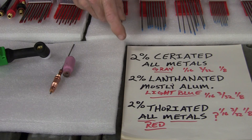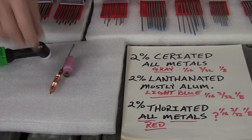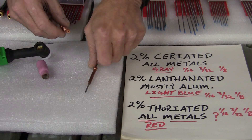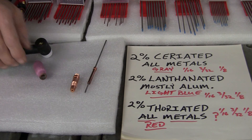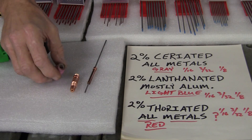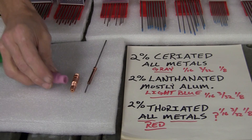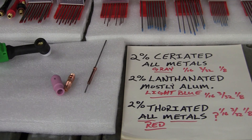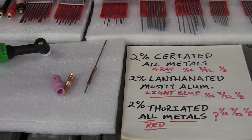When you get your machine set up, you want to decide what kind of collet and collet body to use — it's got to fit your tungsten and fit inside your stinger. With the cup, there are different sizes: this is a number five, for getting into small spots; here's a number six, so you can compare the difference; and then you've also got a number four.